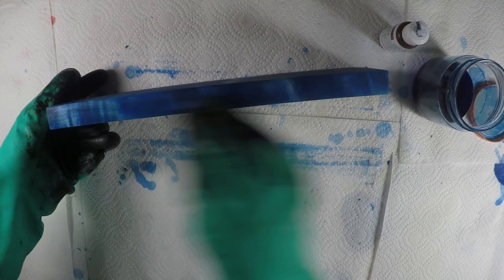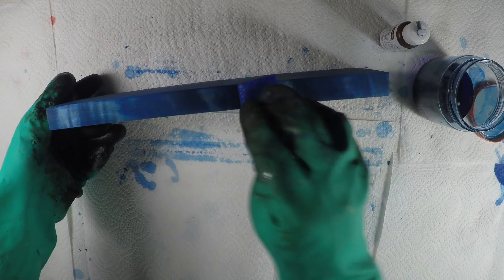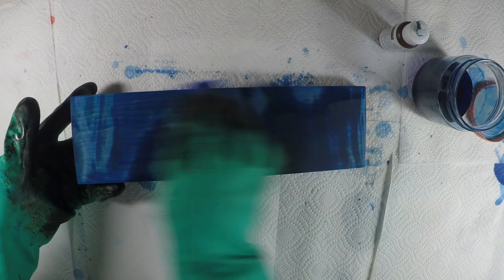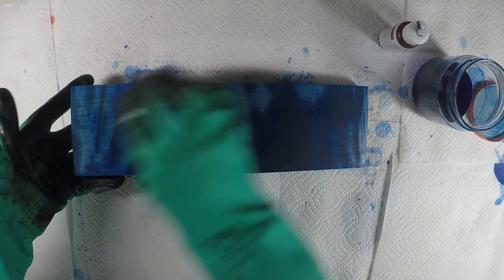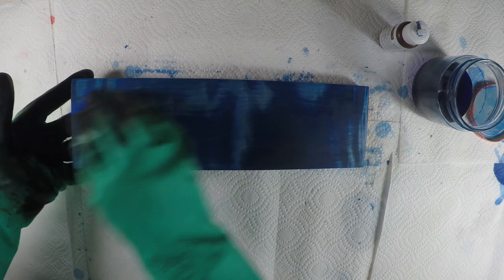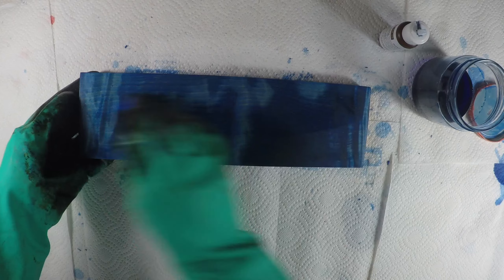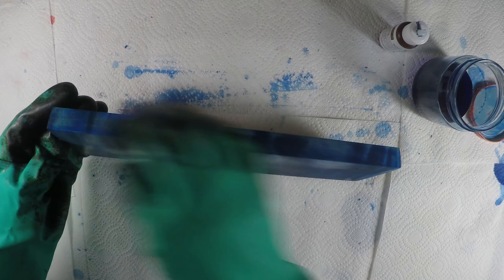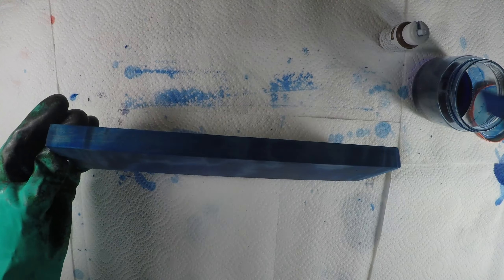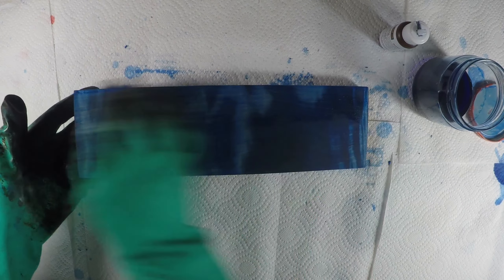I just learned a really nice little trick yesterday: if you end up taking a planer — because these liquid dyes can penetrate quite a bit and it can take some time to sand back — you can just take a planer and do a plane after they've dried and just remove like maybe a 64th of an inch. That's sure faster than sanding and will definitely take off the surface dye pretty quick. I talked to a very knowledgeable man yesterday — that's what's awesome about this, you just learn so much from other people.